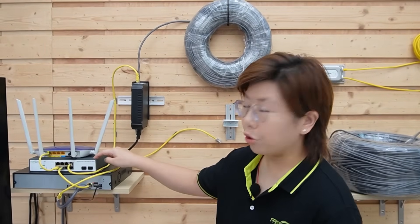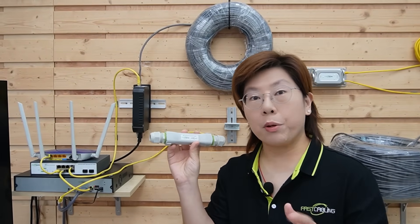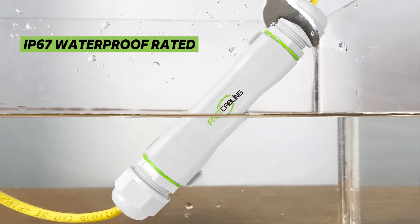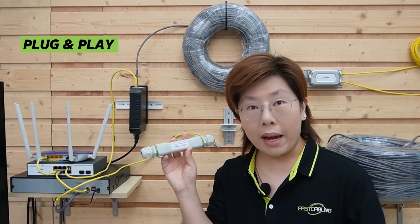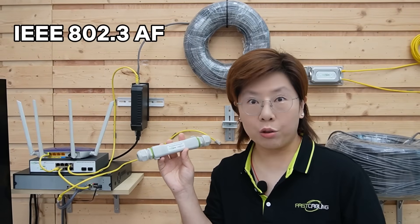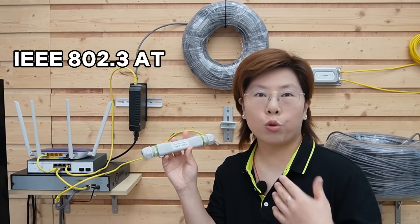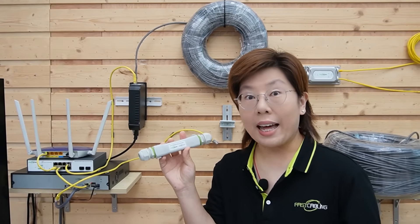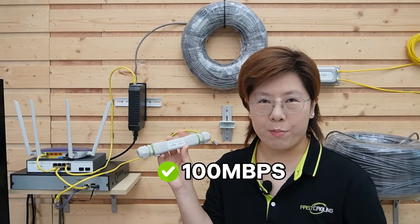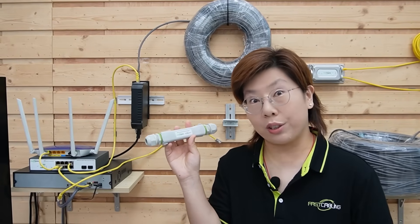Let's do it. In our layout, we'll come out of the switch to our first extender. This extender is built for outdoor use with IP67-rated housing, plug-and-play install, and it's meant to simplify long runs in the dirt. The kit supports IEEE 802.3af and 802.3at standards with up to 25.5 watts at the far end and 100 Mbps data — plenty for a typical video door station or bullet camera.